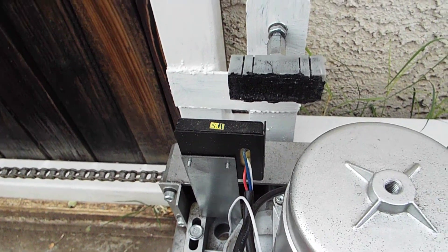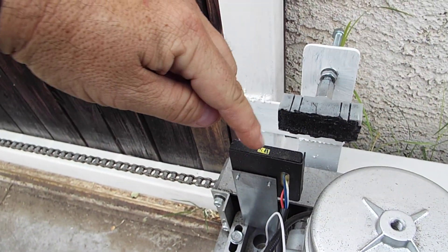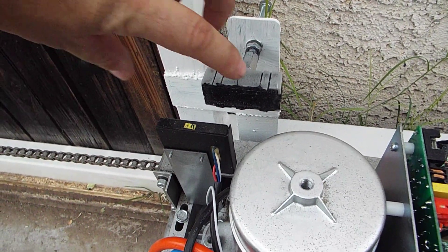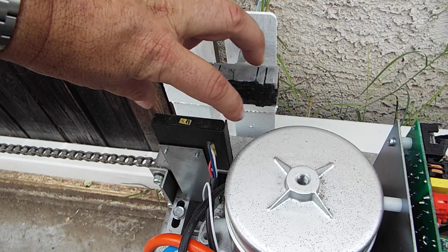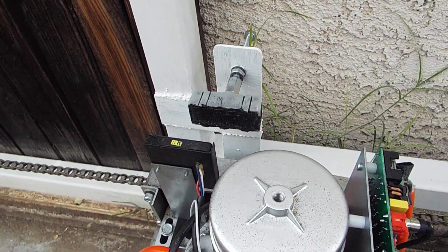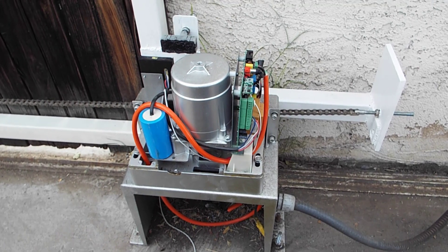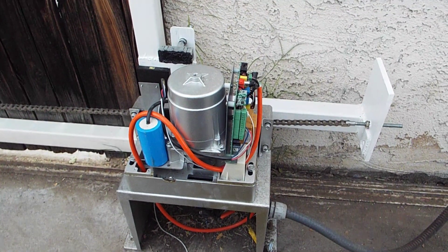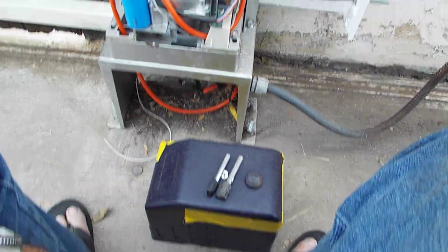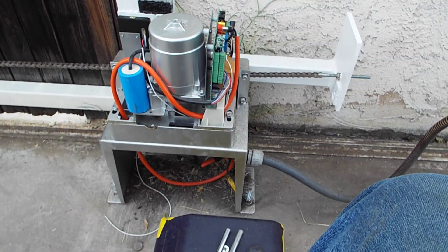The other key thing is where the sensor comes to a halt in the closed position. As you can see, the sensor when closing comes to about the halfway point of the base sensor. So when thinking about where to mount your bracket in the closed position, don't expect it to be completely aligned and centered — consider that when mounting. Hopefully this helps. If I'd seen this video it probably would have saved me about three weeks of extra work. It works perfectly now — going to put the cover on, take off the duct tape, and put the access plug back on. Thanks for watching.